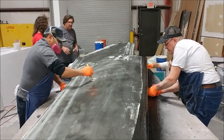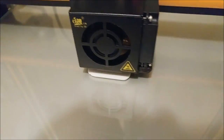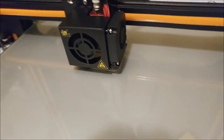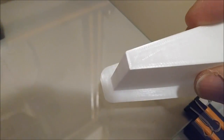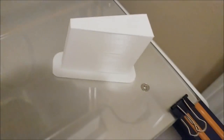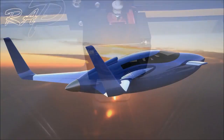Lastly, I finally found a reason to buy a 3D printer. We got a pretty good deal — under four hundred dollars — with a 12 by 12 inch platform that can print up to 15 inches tall. The goal is to experiment with printing ribs that we can just lay down on a flat board and pull a mold off directly, skipping the whole process of milling foam, creating a platform, glassing it, spraying putty, milling again, sanding, and priming. Most of these ribs are basically straight up. If it works, that'll save us a ton of time by only having to create the molds. Anyway, that's your update for the first half of this week — thanks for watching.